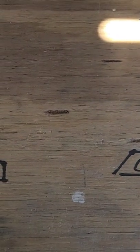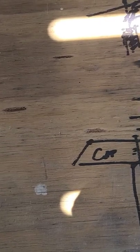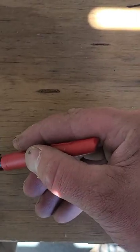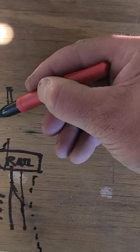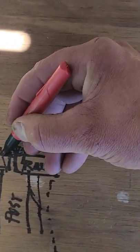The problem with exterior, the obvious difference, is that exterior stuff is exposed. So if I just do the one fastener through the middle, there's a really good chance that it's going to deteriorate over time. Even house trim is vertical, so when it gets rained on, if you've got a piece of trim that's spliced right there, that rain is just going to drip right down it. When your cap rail on your deck gets rained on, it literally just sits right on top of it. So over time, these ends tend to pick up and away from each other. They'll start to curl up and out.